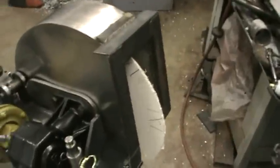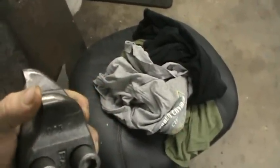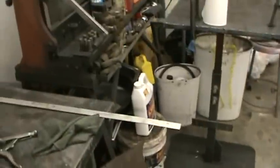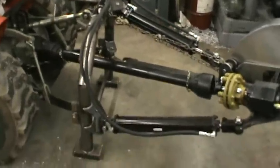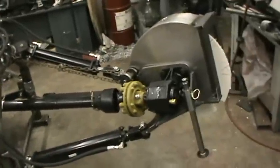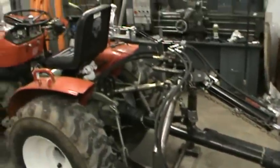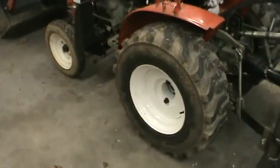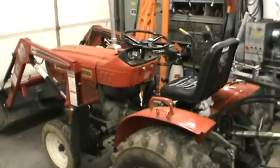That's where we are on the update of the stump grinder. The next thing is to start doing all the machining on the wheel — I've got a piece of three-quarter-inch plate I've got to burn the circle out of. Here are the teeth — they were bought off eBay off of a Rayco stump grinder. I had to resharpen them, but I got a lot more than I ever need for half the cost. I've still got to make the wheel. It's been a pretty good project — I'm probably at close to 80 hours in what I have done here. Maybe the next video will show making the cutting wheel and the teeth. If anybody would like to see more about a Yanmar, just message me, and maybe I'll do a video about pricing, where to get stuff, and what size the wheels are. Till then, have a good one.